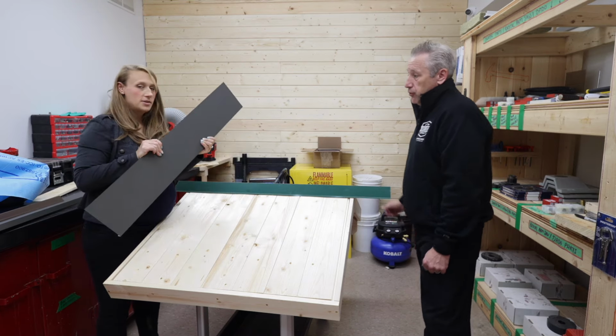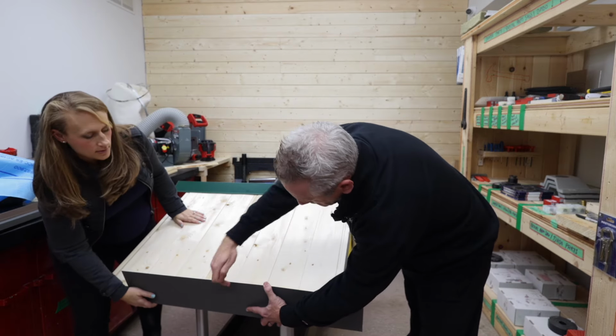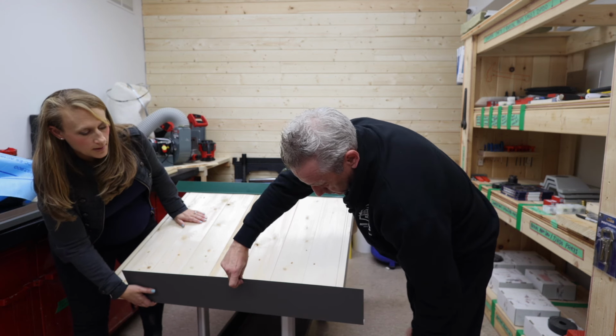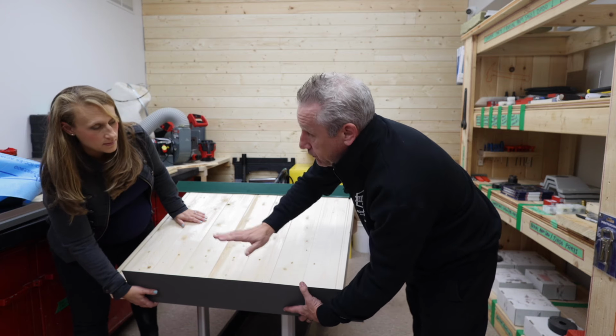Cover the edge. So to fasten this, as it goes in place, the strapping's up here, you're going to put a screw right through the top here or a roofing nail, and that'll hold it to the strapping and hold it in place. Not underneath. Although if you wanted to, you could, and some do, it's fine. But I like it where you don't ever see the fastener.